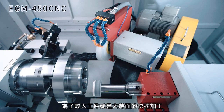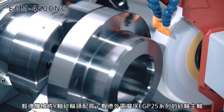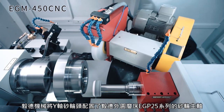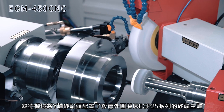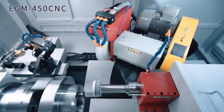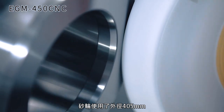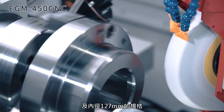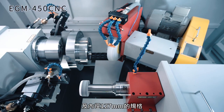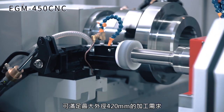The EGM 450L is designed for larger workpieces or rapid processing of large entities. E-Tech Machinery has equipped the Y-axis grinding wheel head with a grinding wheel from the EGP 25 series. The wheel has an OD of 405 millimeters, a thickness of 50 millimeters, and an ID of 127 millimeters — meaning they can process up to an OD of 420 millimeters.